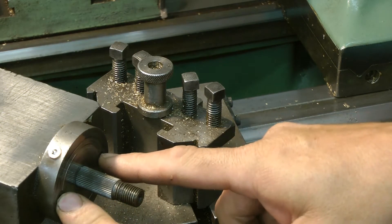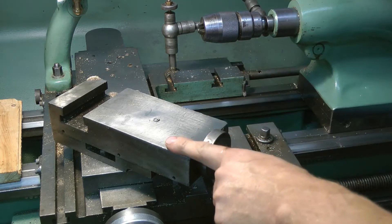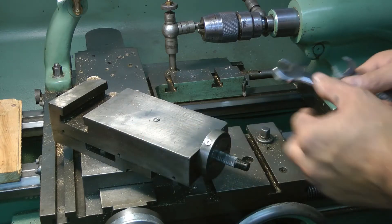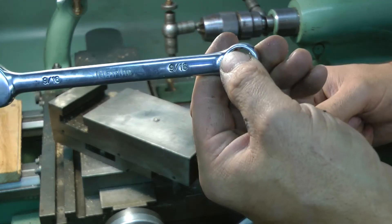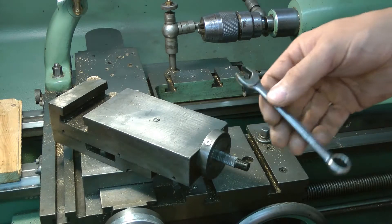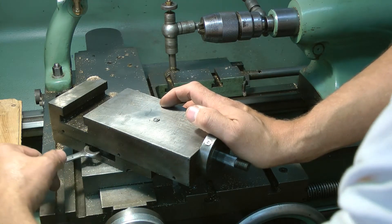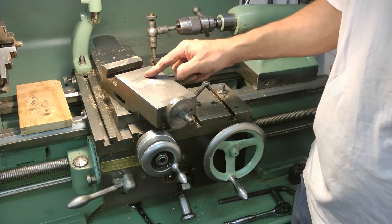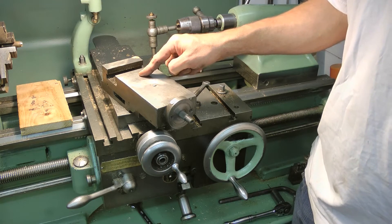There's two little Allen head bolts so I think we'll whip them off. Having a think about it, I've decided it may be better to remove this and take it over to the bench so we can have a better look at what's happening underneath. I'll just need to detach this from the main body, from the saddle. I would have thought it would have been a 9/16ths because 1/2 inch is too tight, but it turns out a 9/16ths on my lathe is too much slack. Strange enough, a metric size fits — 13mm. So it's just a matter now of taking these off. The compound slide has now been unbolted — that's a good opportunity to have a look and maybe give it a good clean and a service.